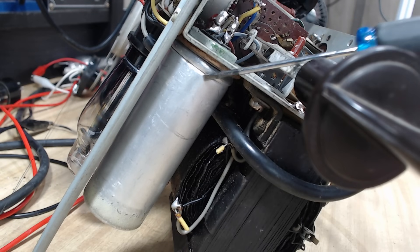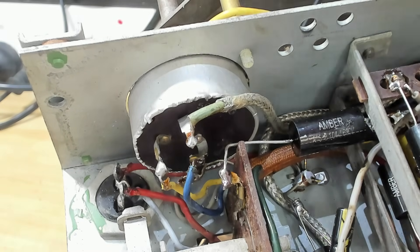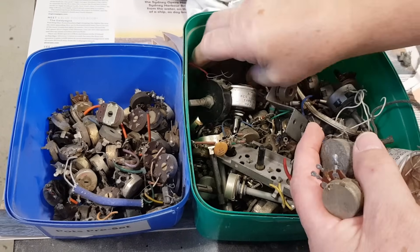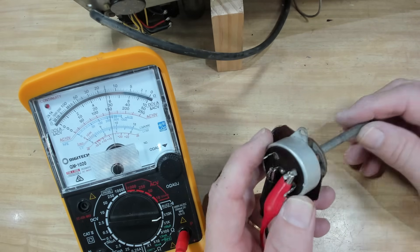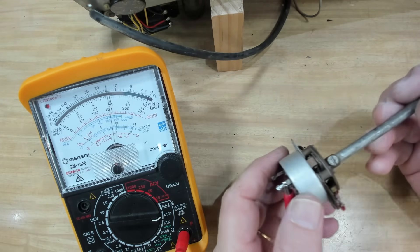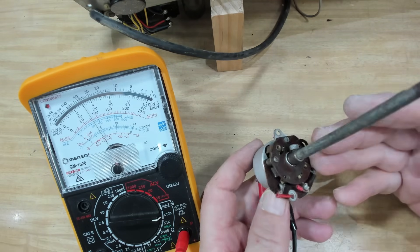The adhesive's dried; I've refitted and soldered the capacitor back in and it tests perfectly. Next is the volume control — someone's been in it before and crimped it back, but it's not working properly. At the radio auction I picked up two containers of potentiometers, and sitting right on top was the exact correct potentiometer — switch on the front, pot on the back, exactly the right value. The action is smooth on the meter. I'll install this and it should fix the volume problem.